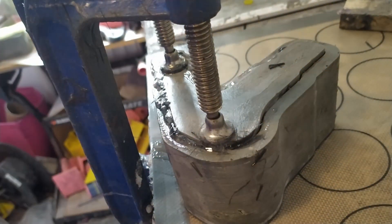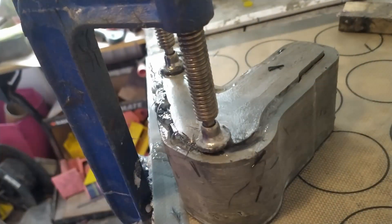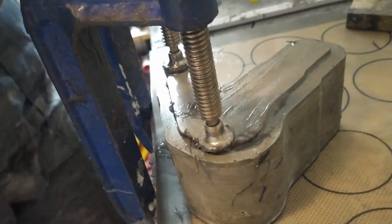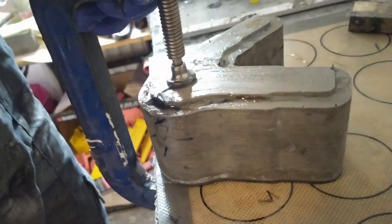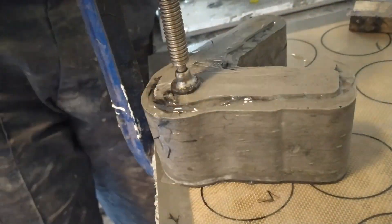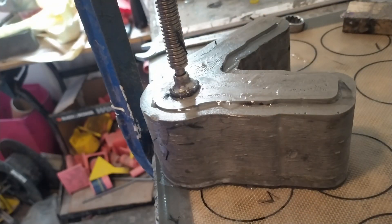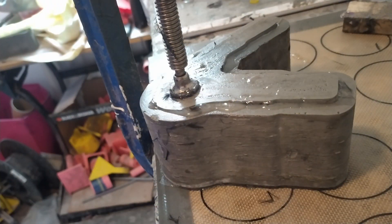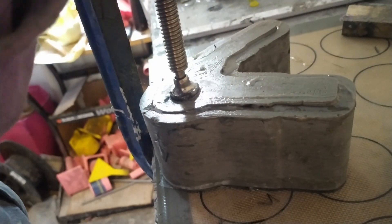In the background while I've been waffling, I've been on 5x speed getting the compression done on all of this lot. I've got some improvements planned — a big plate of steel coming in to make a better compression jig. But for the moment in this video, a couple of G clamps and a bit of patience. You can see all of this resin coming out which I'm regularly wiping up, and you can see all the bubbles moving along. This whole process took about half an hour to 45 minutes, progressively squishing it closer and closer.